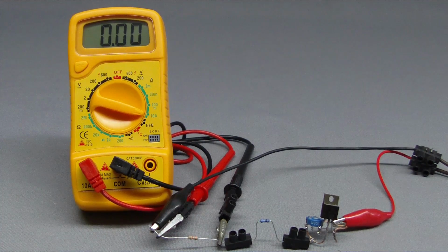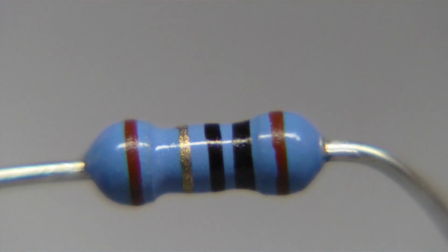What happens if the multimeter, which is connected in parallel to the resistor for doing voltage measurement, is switched to current measurement by a mistake? Well, the internal resistance is very low while switched to current measurement, hence the resistor connected in parallel to the multimeter gets bypassed and a high current is running through the circuit and the multimeter. This may cause the damage of devices. In this case, the transistor used to adjust the voltage output could be damaged.